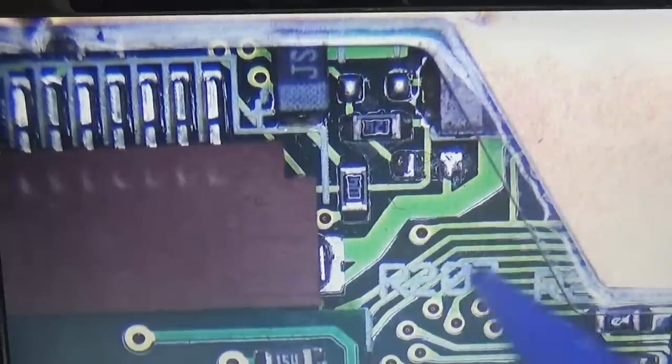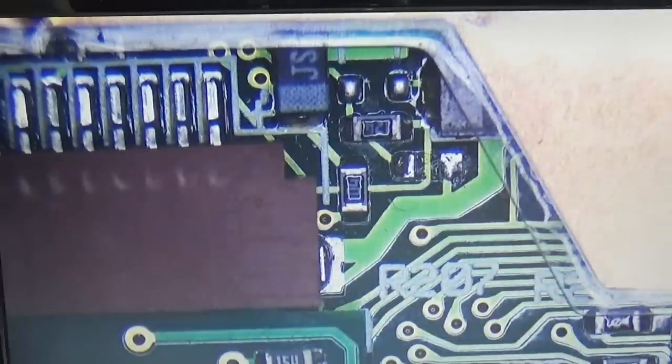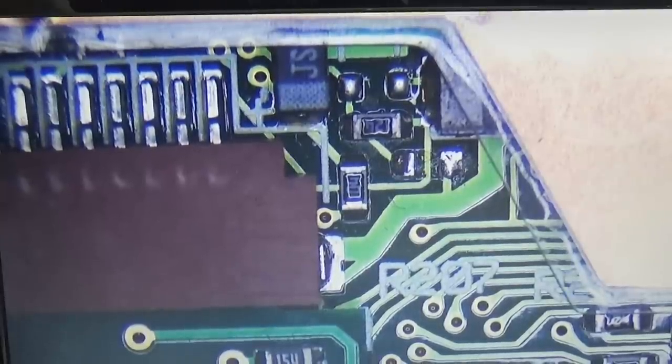On the other hand, we can clearly see here that somebody already was in and was trying, obviously, to extend the frequency. I do not see the second part, which is a diode, and therefore I have, let me see if we can get it here into view a little better. So we have here the copper shielding, and we need to lift it up because the second component which needs to be changed is under this copper shield. So that is of course the solder point where our copper is soldered here to the unit, and now let me try to lift it up.